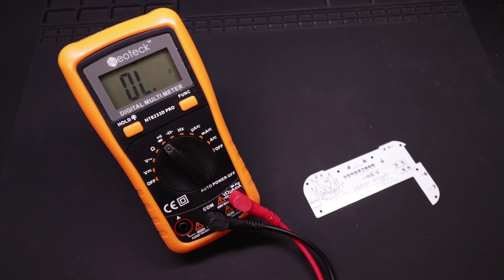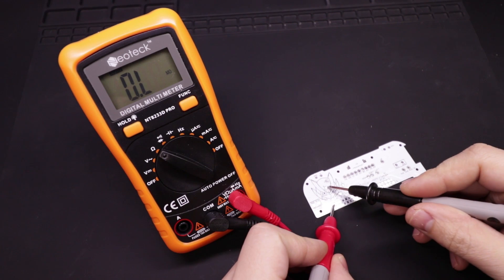The last bigger item I'd recommend getting right off the bat is a multimeter. Believe it or not, this is actually something you can get away with using a cheaper one and it'll get you pretty far — I used a dirt cheap one for a number of years before upgrading recently. The things you'll be using it for are measuring voltage, current, resistance, and checking continuity — which is just a fancy way of saying checking that two points on a board or two wires are directly connected, so you can verify that your solder joints are solid. The two things I'd look for are: first, beeping on continuity check, which means the multimeter just beeps whenever you find continuity between two points. Without that, you can check continuity by setting it to resistance and watching for the value to drop to zero, but it can be annoying because you have to position the probes and keep an eye on the screen.